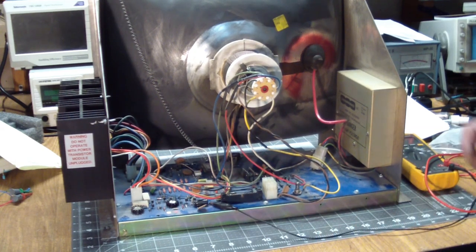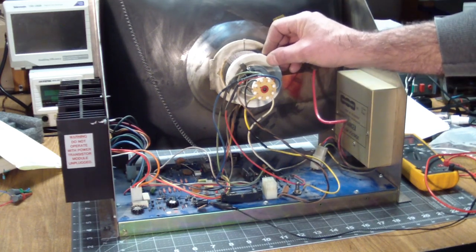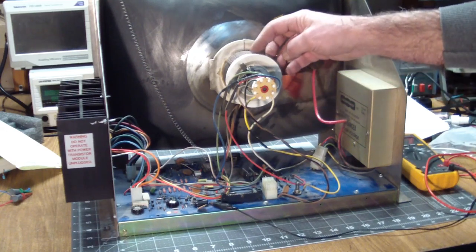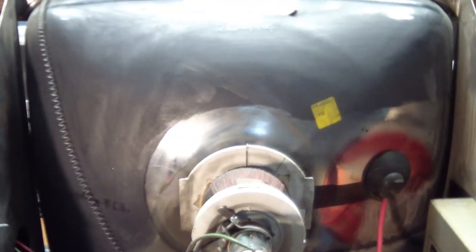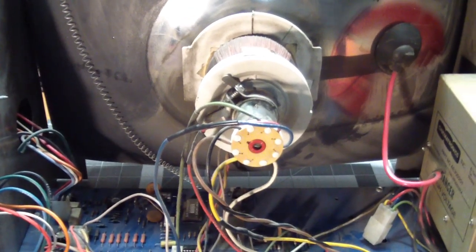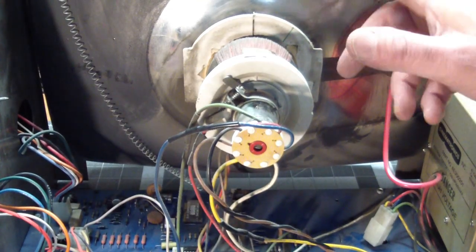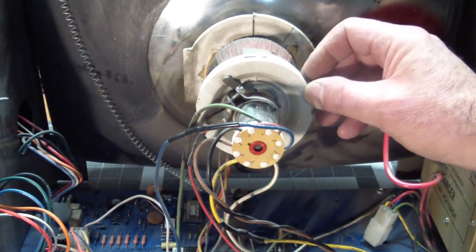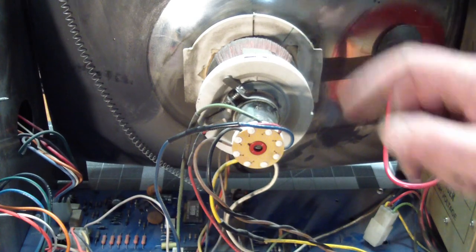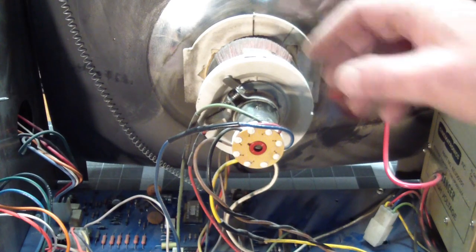One other thing to note was the yoke over here, which has the deflection coils in it. It had slid all the way back here. It was flush against the connector. And what I mean by that, see how the tube sticks out here and you can see the glow? Well, originally when I got it, this was slid back all the way, covering this part of the tube entirely. So this cabinet was dropped pretty severely,